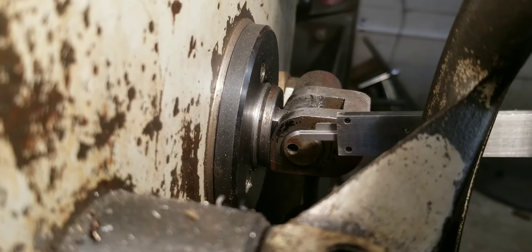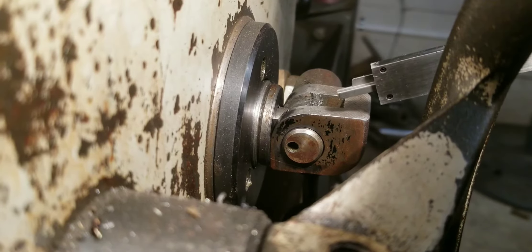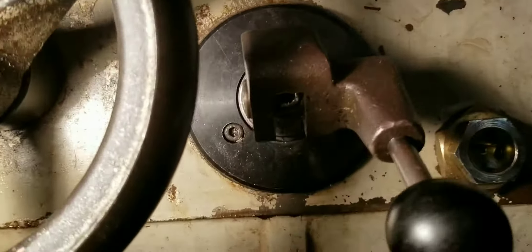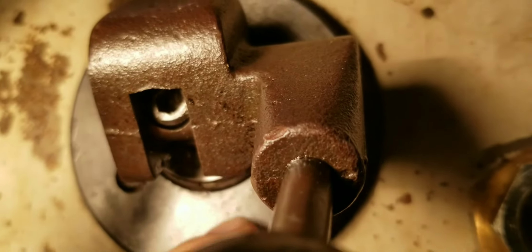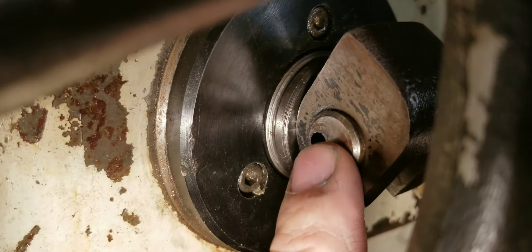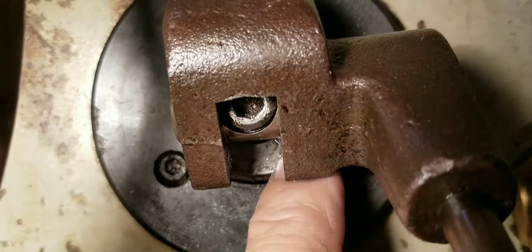So you want to drill your square block a half inch from that edge, drill it through, and then round this corner. There's a slot in here to fit over the nub that sticks out — just measure your nub for that, but it looks like about a 1/16th slot. That screw goes through the pin but is not threaded into it — it just passes through. There's a hole drilled through this way, and the set screw tightens up on that screw to keep it from backing off.